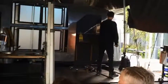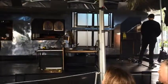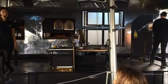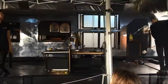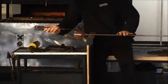So now you can't even tell that there was a seam between the clear and the rest of the body of the piece. Manny used heat to his advantage and he just melted away that seam. It looks like they were part of the same original mass. Pretty cool. I'm just gently pressing these two paddles together, and Manny's gently guiding the sides of that bubble into shape.